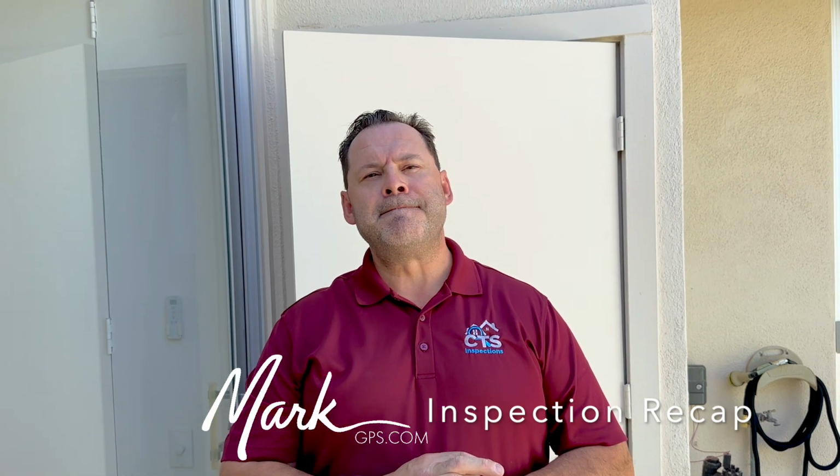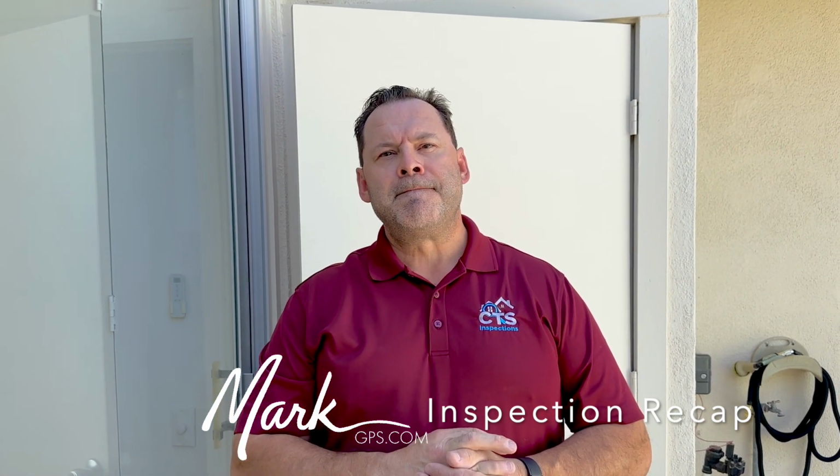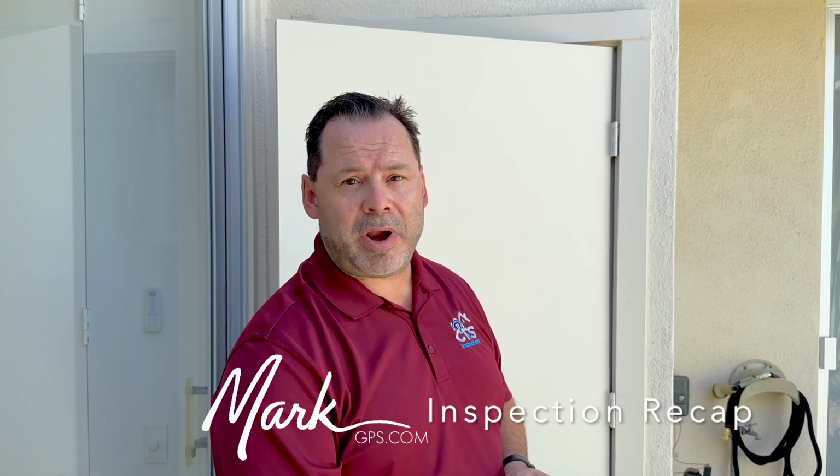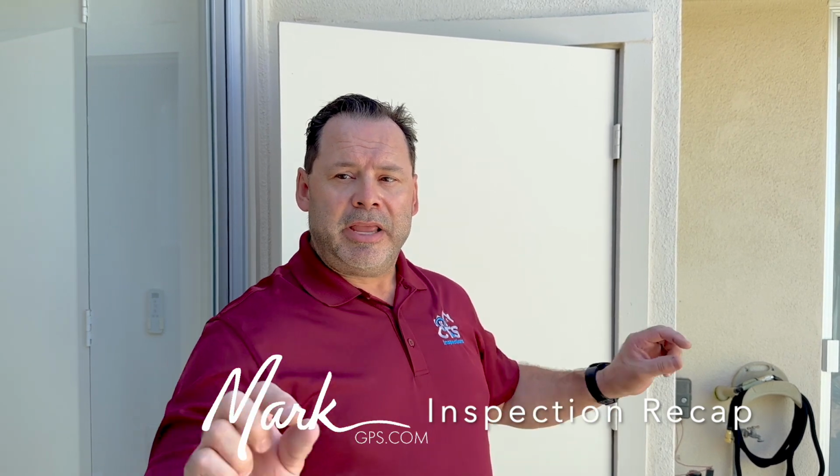So all of the original frames and rollers, they all seem to work? Very clean, yeah. Okay. Yeah. I did note that a couple of the sliders, the east and the west bedrooms, those lock latches don't align and seat. All of the sliders have a secondary lock on the track that keeps it locked. But if you didn't want to use those and just wanted to use the latch on the handle, the ones in the 2 guest bedrooms don't seat. They'll need adjustment in order to latch and seat secure.